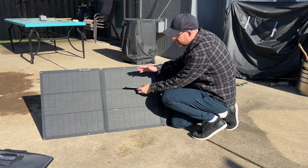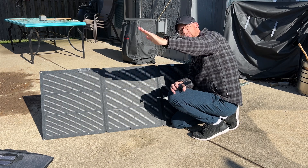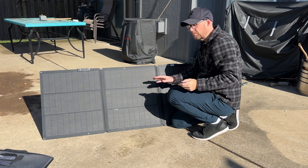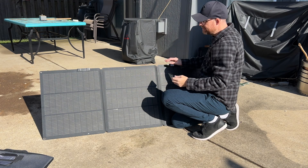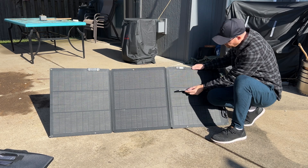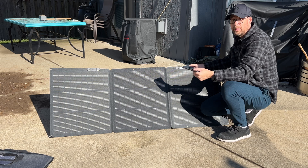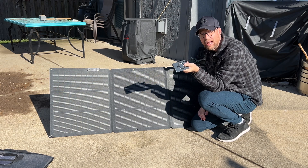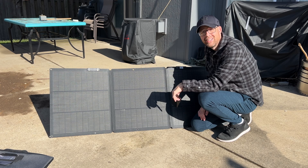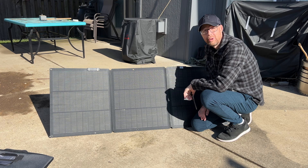Now I might want to adjust my solar panel a little bit more, but it's going to be moving this way over the next few hours so I really don't want to adjust it that much — I'm pretty good at this point. But if the solar panel was angled even more down, the shadow will increase. You can basically use any kind of flat object you might have laying around to tell what kind of angle you have, and that's how you properly angle your solar panel at the sun as a portable solar panel.